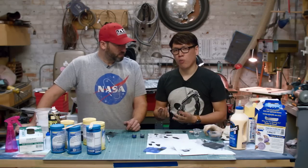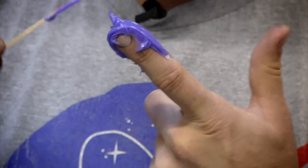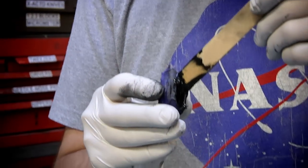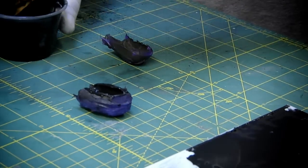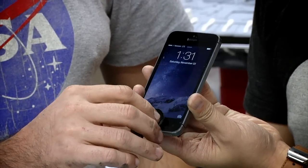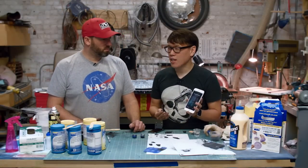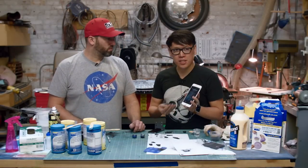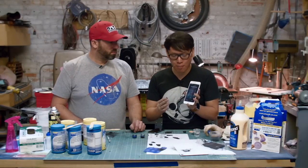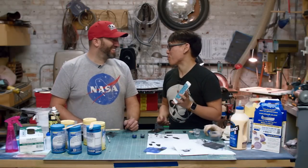In experiment one, we did a silicone casting of your finger using a silicone mold carefully made of the same index finger. We infused it with graphite, which by itself didn't seem to activate enough capacitance for the Touch ID ring, but by brushing graphite on top of it, it registered as a finger. And with one of our castings, we were able to unlock the phone. On the new iPhones — iPhone 6 and 6 Plus — Touch ID is theoretically even more improved with a higher-resolution sensor. And even on the 6 Plus where we trained your index finger but not mine, it unlocks.